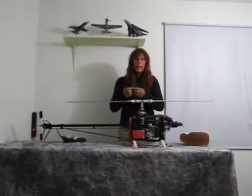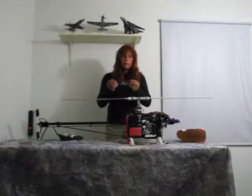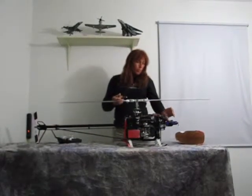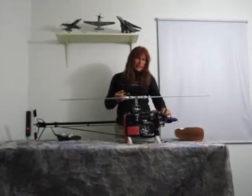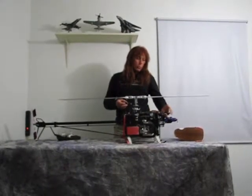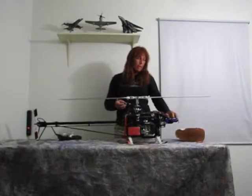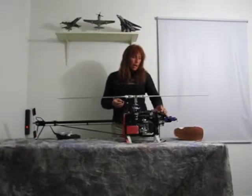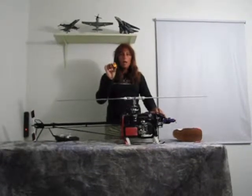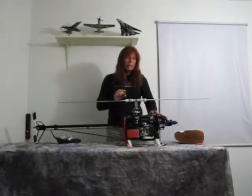What this is — it's a two-cell LiPo battery pack with a little switch on it. It's got a one-way diode in there for one-way directional current flow. What this thing does is you plug it into your receiver, any open port on the receiver, if you're using an external BEC on your nitro machine. If your BEC happens to fail during flight, or your battery pack dies, anything that causes your receiver to lose power — this little thing will sense that and automatically send 5 volts of power to your receiver to keep your electronics running.